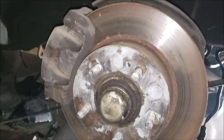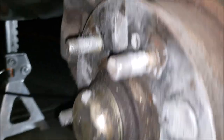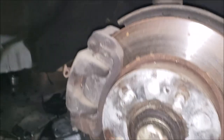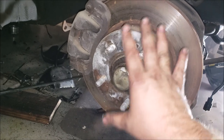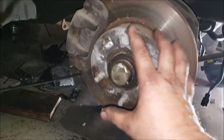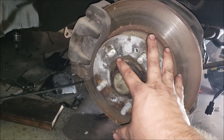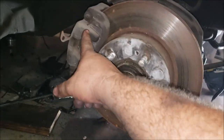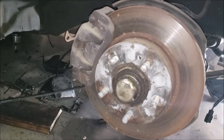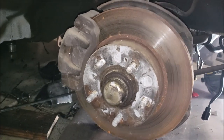Probably just to look cool. Hey, we still got brake pad life - though that's all going to get changed. Supposedly S13 or S14 Silvia knuckles are actually able to be used on our spindles here so we can increase our steering angle. That way we can upgrade our brakes to maybe the 300Z brakes we have over there from another project - though I don't think we're going to go that route, we'll probably just throw them onto here.